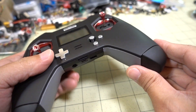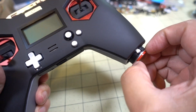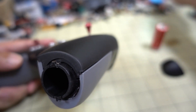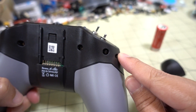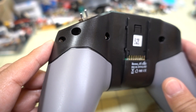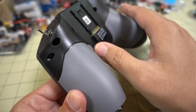If you do have that capacitor issue, you're going to have to desolder it, solder little wires on there, and then lay the capacitor flat — that's the only major complication and not all of you will experience that. In terms of getting this open, it's actually pretty straightforward. You just take the little caps off and pop them off, take the battery out. You're going to remove the two screws on the far outside of the back. You don't need to mess with the inner screws — I left those alone. Some early units don't have those outer screws, but if yours does, you've got to remove those two screws.